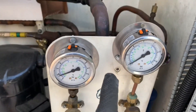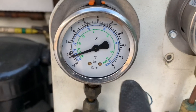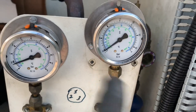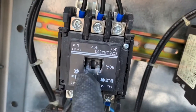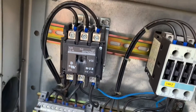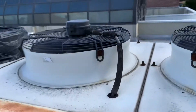Circuit number two is currently empty — zero bars, zero bar. Even the contactor right here is disconnected. This contactor is pretty much beat up — you can see all the arcing marks. It's dusty and dirty; that definitely needs to be replaced.